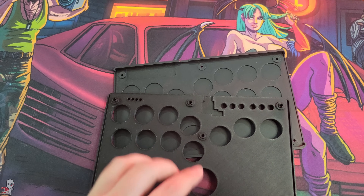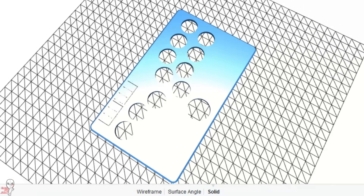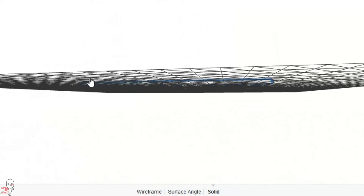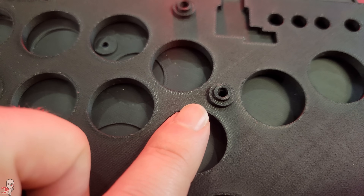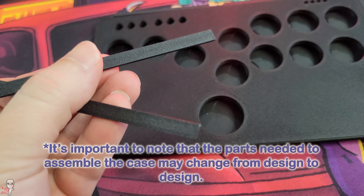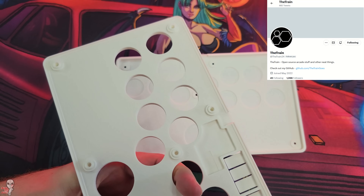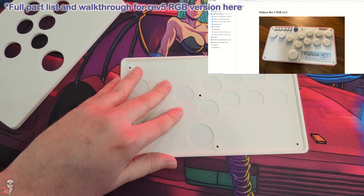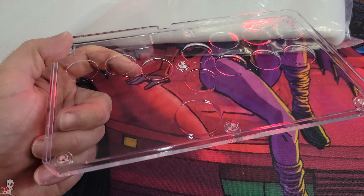If you have access to a finely tuned printer you can do this yourself, but one of the biggest issues people new to this may run into is sub-par print quality. Something can look okay but still not fit together properly. The design is ideally looking for 0.1mm XY tolerance, but in some specific problematic areas you could open it up to 0.5mm. There are multiple case options — some styles come in two halves, others include tiny side panel inserts. I sourced this Rev4 shell from my buddy The Train, who has a higher end 3D printer, but to help demonstrate variety, I grabbed an additional shell for the advanced version from the video sponsor, printed in PCBWay's UTR 8100 transparent resin.